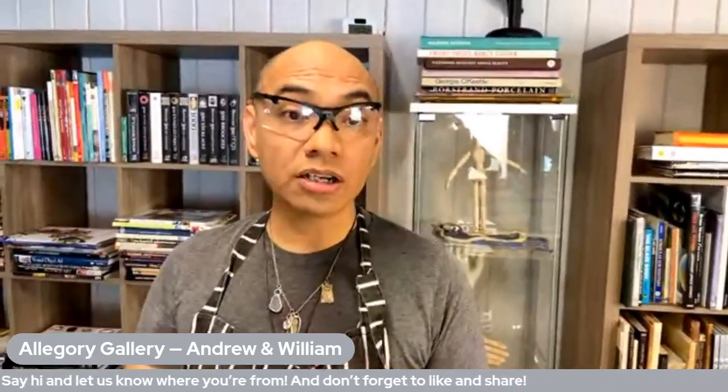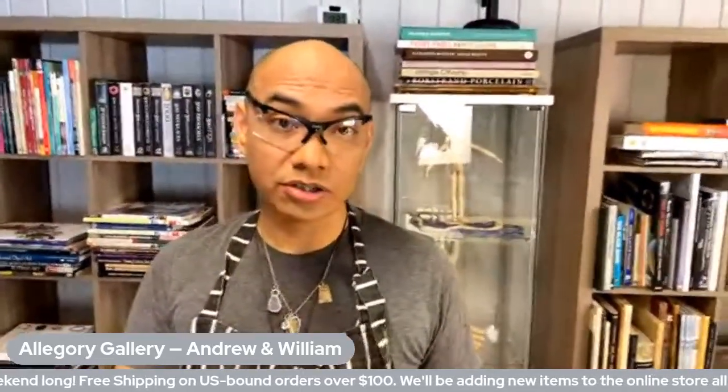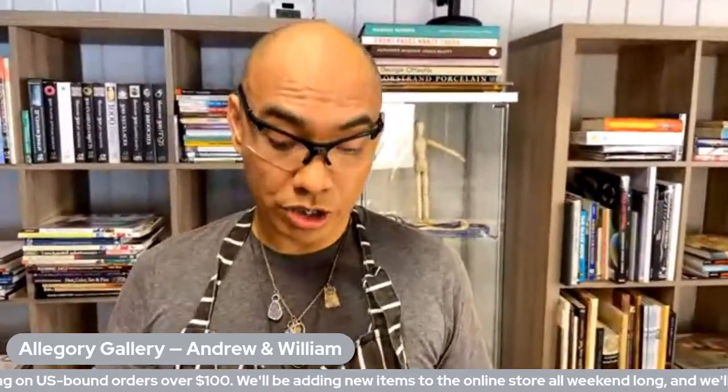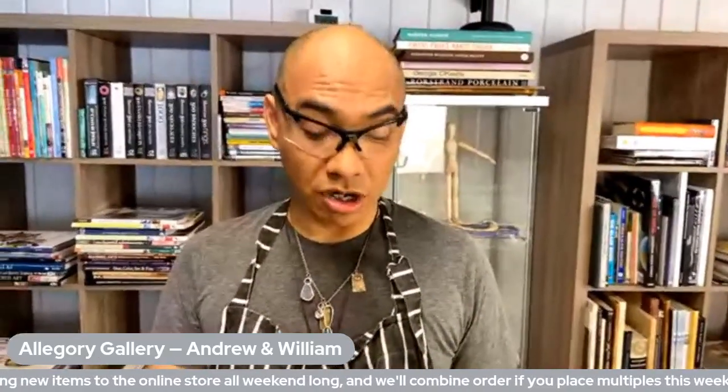If you're really concerned, you can take this to a buffing wheel and put a little bit of Zam or any kind of polishing compound and shine that out super bright. And you may be wondering, why are you going to do that? The reason why is if this is super crusty and textured and there's all this pitting and rust and stuff, when you put this texture onto your metal, it's going to leave those marks. It's called telegraphing, and you don't want that. Or maybe you do. Maybe ding up that thing all day long and add your own texture, and you can do whatever you want, feel the energy, your creativity, whatever you want to do.